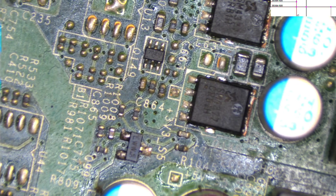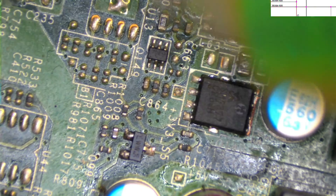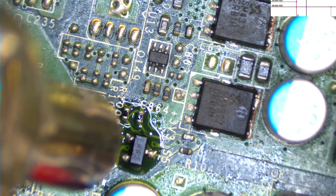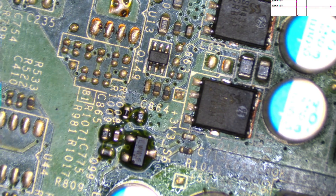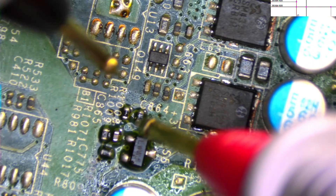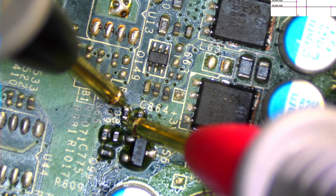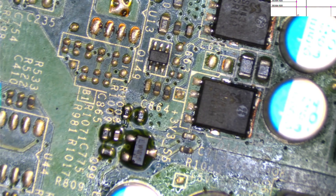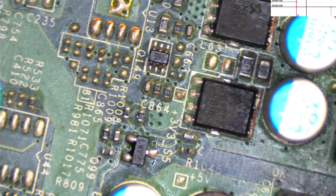Let me try and reflow that resistor. After reflowing, let's measure it again — now we are reading 46 kilo ohms and it is rising. Let's wait for it to cool down and measure again. We still read 50 kilo ohms.